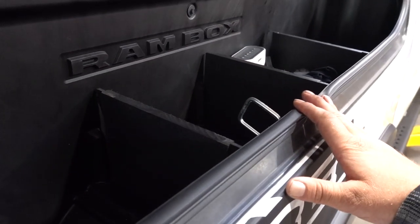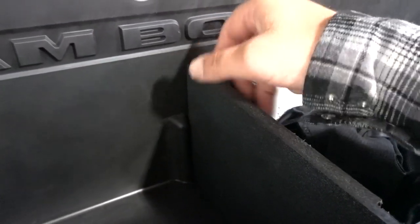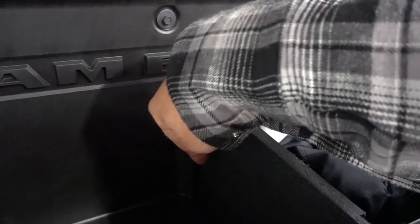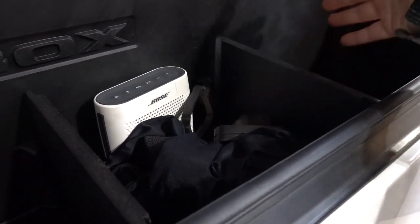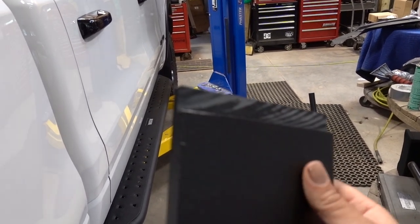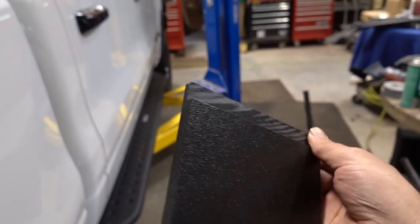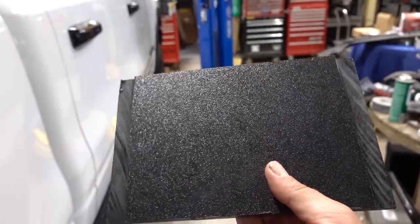As far as changing up the design — this loose one at the back moves at the top because it tapers, tighter at the bottom than at the top. You could get fancy and shave them down to a point at the end so they get thicker toward the top, but I didn't want to put that much time into it. These are going to do the job and come out really nicely. I only cut one side on these to give me more control over the thickness — basically taking up blade widths with the table saw. I've got one more to cut and I'll show you how I made these reliefs.